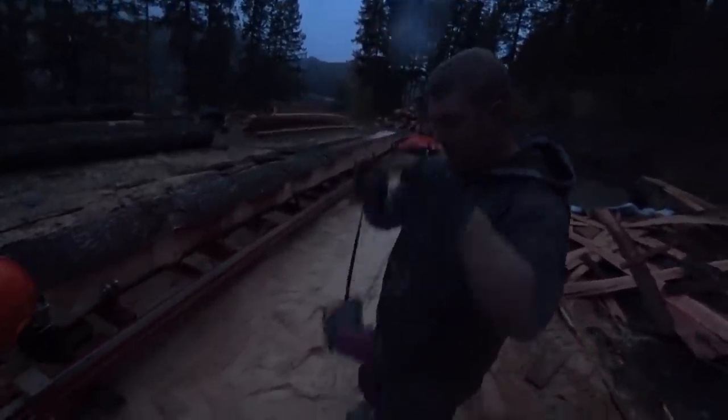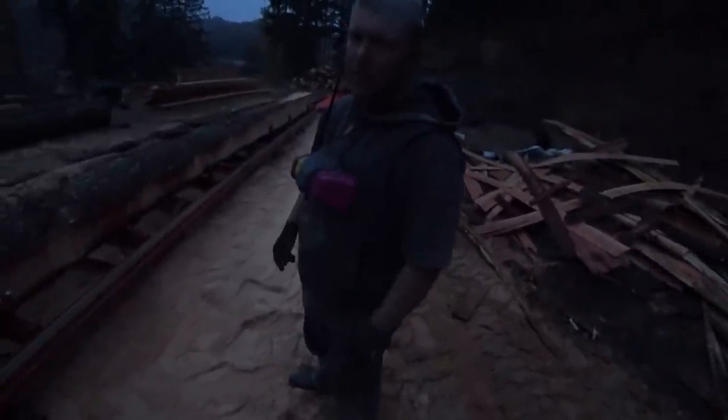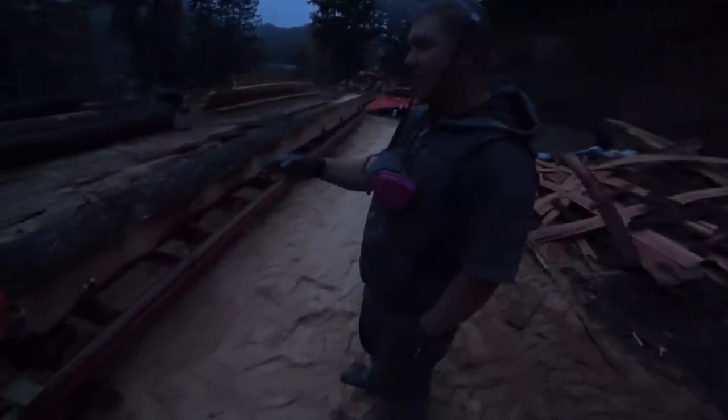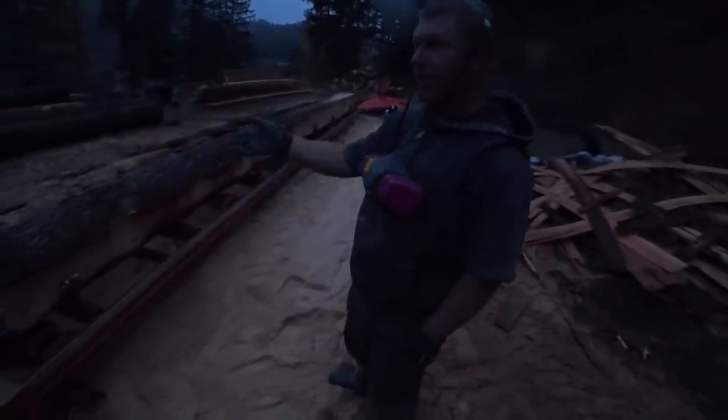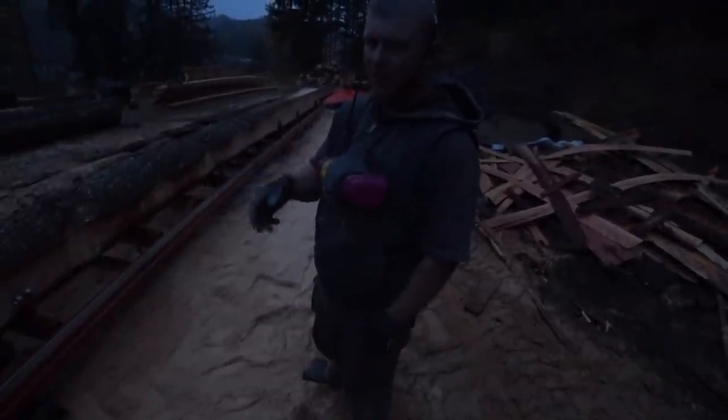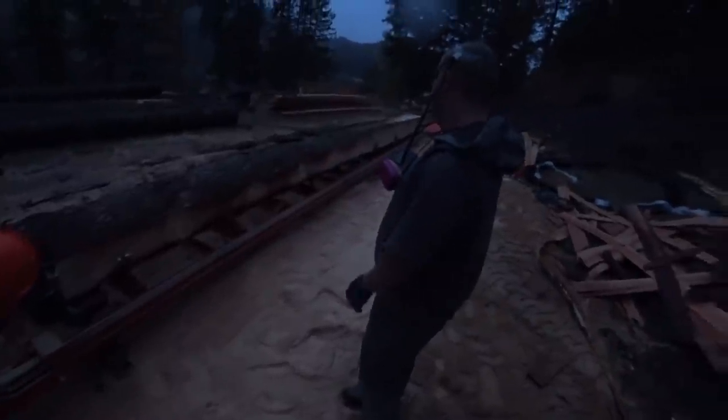I've kind of been doing the same thing with the planer. I'm doing little bits, but as I get more confident and understand it, I'm going right to the dimension. Like this log, it's going to be really close. The first two logs this morning both had huge butt swells, so it's conservative cut, conservative cut, over and over, like you're literally rotisserie-ing this log. That's why I wanted to put these up here and go at it, get the timber we need, and if we get anything else, great. If not, firewood. So now it's time to feed your belly.